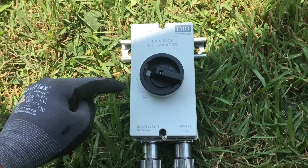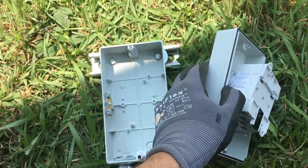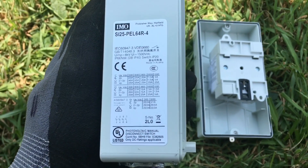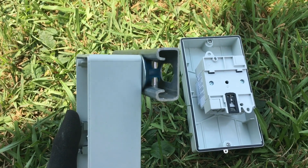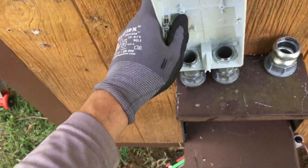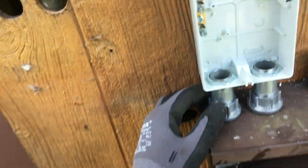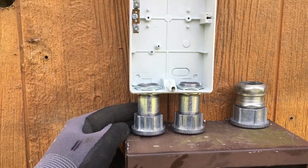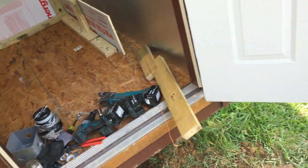With your IMO switch — just this part right here — this is a switch we use a lot. It just comes apart. This is actually what's on the side of most inverters for DC disconnect. First thing I do is take it loose, make some holes in it, attach whatever conduit fittings I'm going to attach — usually attach some strut on the back. That's unistrut with quarter-20 strut nuts and washers. That really firms it up. The switch feels a little economical on its own, so I like to firm it up with some strut. When it's in there like that, I'm not worried about it. Mount it there and there, and you're ready to wire it up.